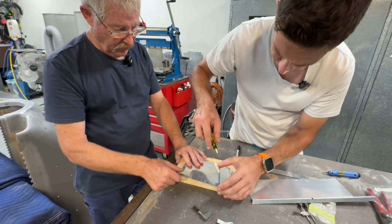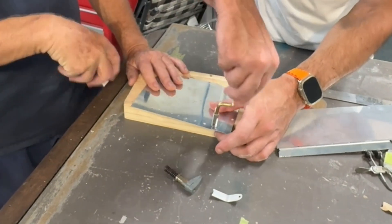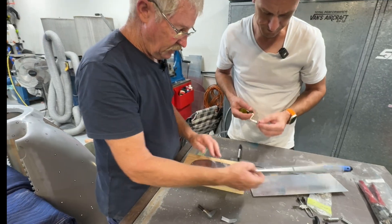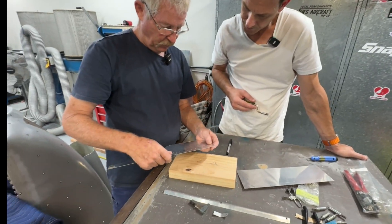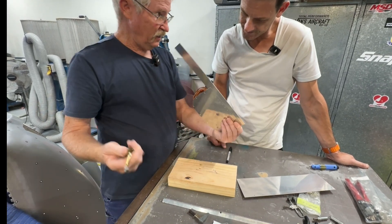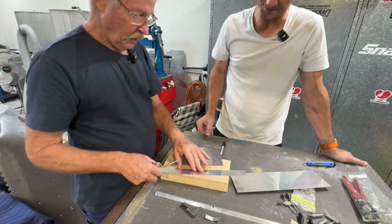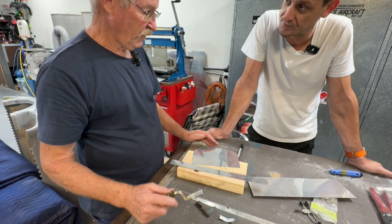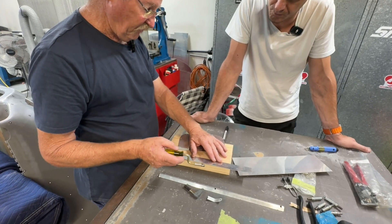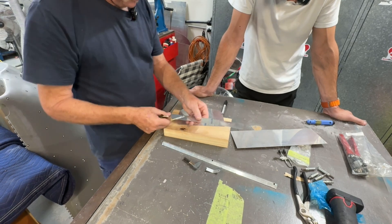If we don't take the hard edge where the drill's gone through on the other side, that gives us some really tough stuff. We said to the kids last week, their project says you've got to deburr it. So they deburred this side and this side. And we said, hang on — what about this side and this side? Oh, forgot about that. So it's 75 to 80% preparation in the build of an aircraft — this deburring stuff — and then perhaps 20% is the assembly. That's the good part where things start going together. But it's this tedious stuff that takes the time.